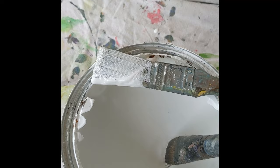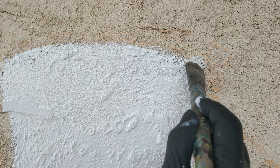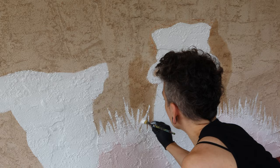This primer is really thick and it also acted a little bit like a spackling agent because it filled in all the little cracks and nooks and crannies and holes of this highly textured wall. For the lines that needed to be crisp, of course I used a newer flat brush so that I can get all the details in there and it doesn't look frayed and rough.